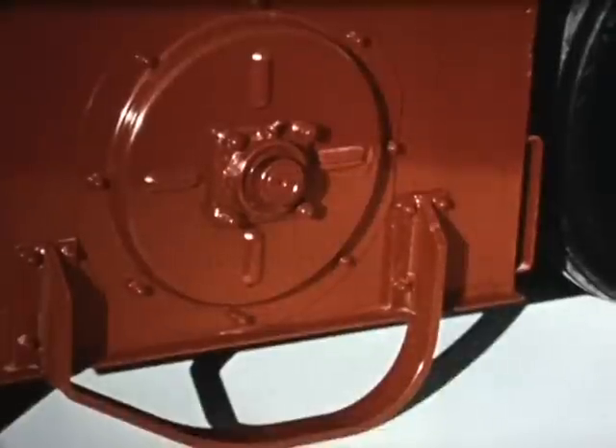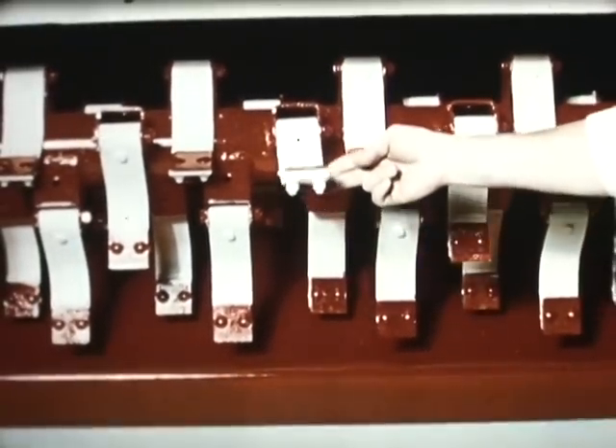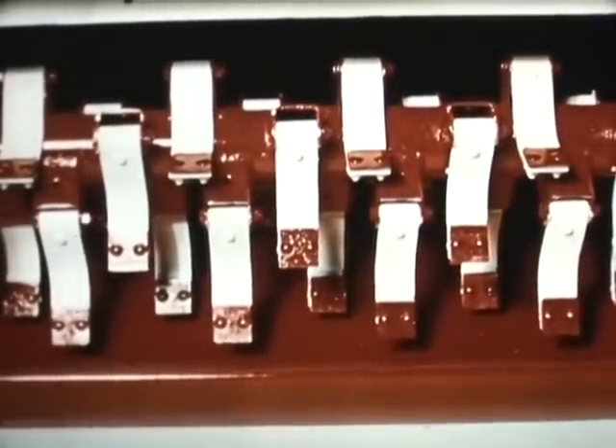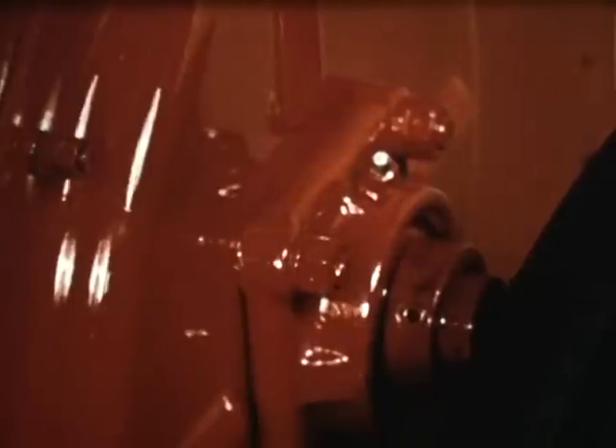To prevent the knives from hitting or striking the ground, a skid has been mounted to the cutter. The heart of every flail cutter is the cutting mechanism, and here the Gale excels. Free-swinging, overlapping cutting tips absorb shocks and jolts, and are reversible for double cutting life, inexpensive to replace. Four adjustable shear bars let you cut clean, short or long, and are also reversible for continuous in-the-field operation. High-speed cutting gives you over 52,000 cuts a minute over the five-foot cutting area. Self-aligning bearings plus the dynamically balanced cutting cylinder deliver a perfect circle of cutting with minimum bearing wear.